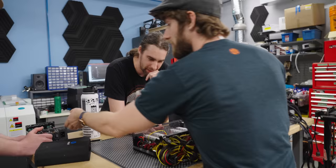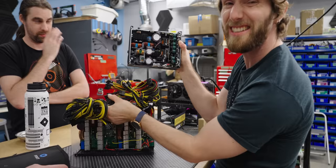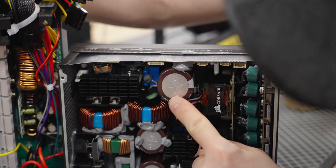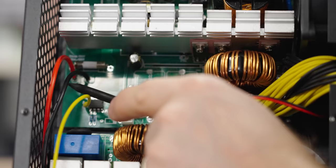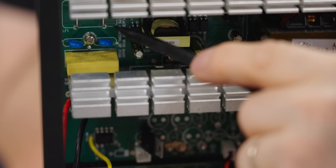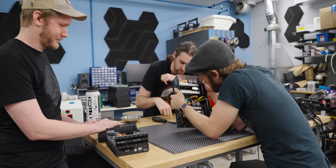Just to validate that, let's have a look at our AX1600. This is what a quality 1,600-watt power supply looks like next to a random Banggood.com 3,400-watt supply. Look at the size of this primary-side cap. We've got our live, our neutral, what seems to be a fuse — that's basically what you call an X-class capacitor. It goes across live and neutral. Right next to it are two Y-class capacitors from your line to chassis ground — it's for EMI filtering.